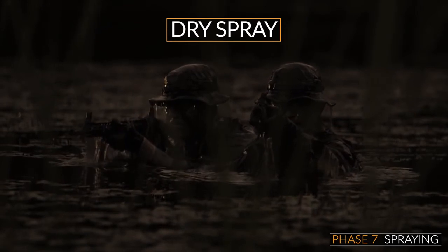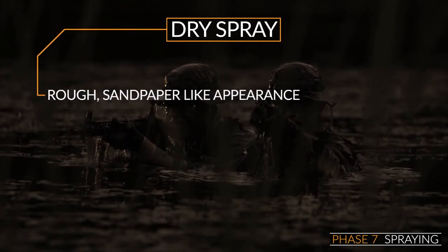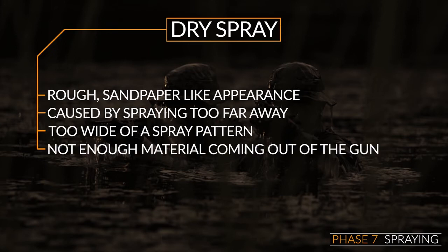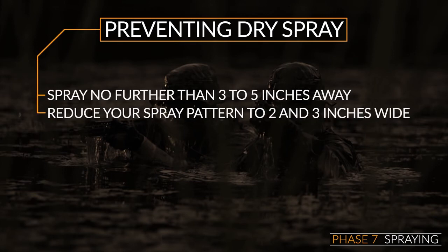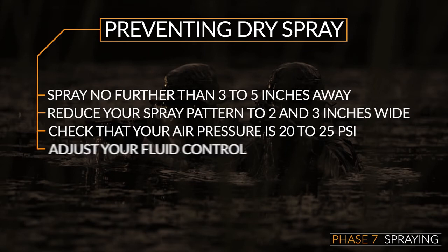The most common application mistake is dry spray. Dry spray has a rough sandpaper-like appearance and is typically caused by spraying too far away from the part, too wide of a spray pattern, not enough material coming out of the gun, or too much air pressure. If you experience dry spray, ensure you are no further than 3 to 5 inches away from the part. Reduce your spray pattern to between 2 and 3 inches wide. Check that your air pressure is no higher than 20 to 25 PSI. And finally, adjust your fluid control to ensure you have adequate coating material being applied to wet out the part in one pass.